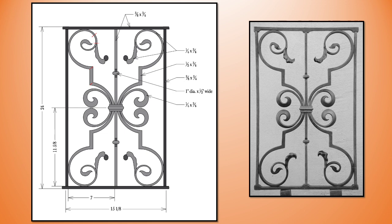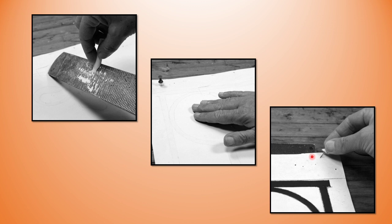You're going to want to transfer the paper drawing to a piece of sheet steel, specifically rusty sheet steel because it'll hold the chalk. You only need one quadrant of the drawing to be transferred as all four quadrants are basically the same piece. Create some chalk dust by rubbing blackboard chalk across a file, then rub that into the chosen quadrant of your drawing.